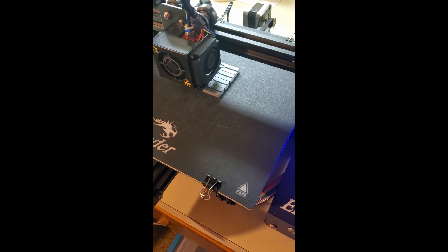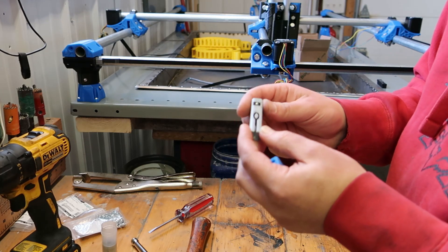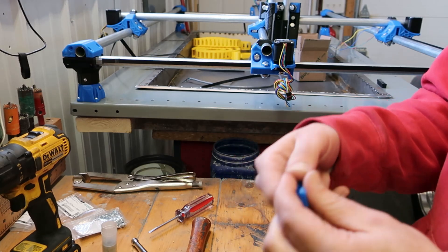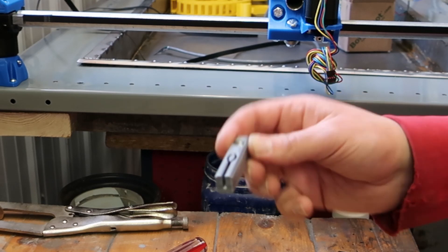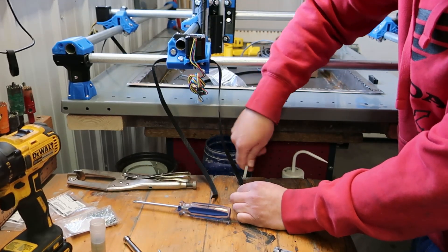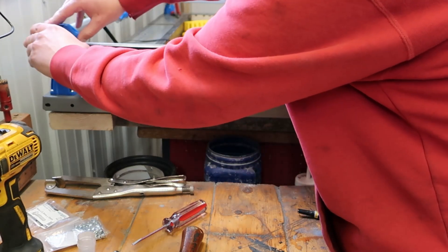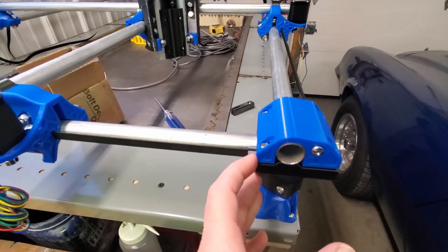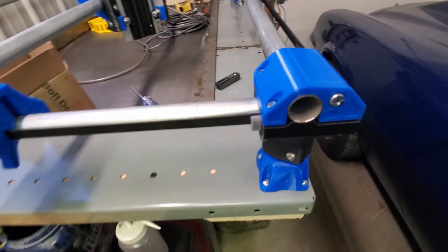Printing up four more. I think you'll save yourself a lot of time if you check your print quality instead of doing a bunch of sanding like I did earlier — can't use these, the grooves are too shallow. So I spent six hours and printed up four new ones. I should have spent a lot more time setting up my printer than printing parts. Now you get the basics of how all that goes together — these plastic holders should be flush with the face of these corners.